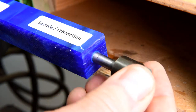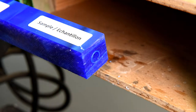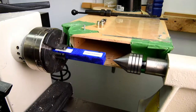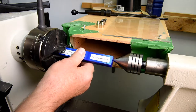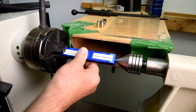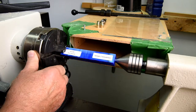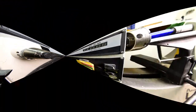Anyway, I'm going to do things a little bit different today. And we're going to try it again, like I did yesterday, only without the screw-ups. One of the things I'm going to do is periodically stop and make sure that the vibration hasn't loosened things up. Like, for instance, maybe the tailstock's coming out, or the jaws are loosening up. That would cause the problem, too. What made me think of that was a comment one of the viewers made.